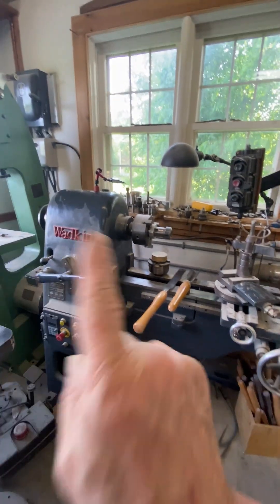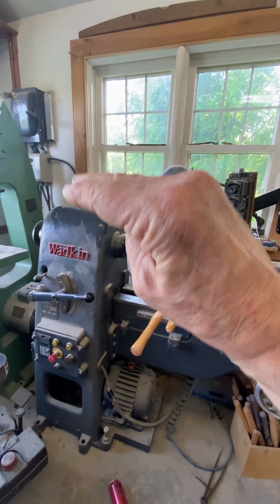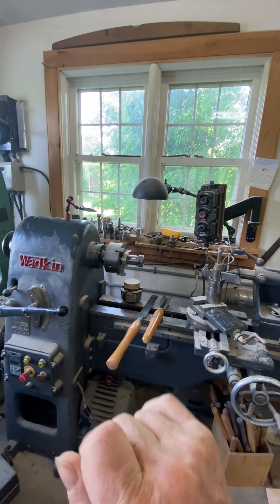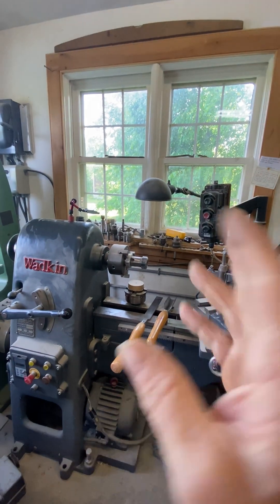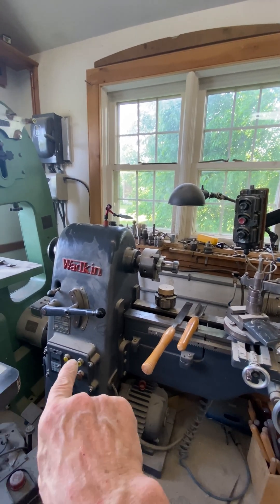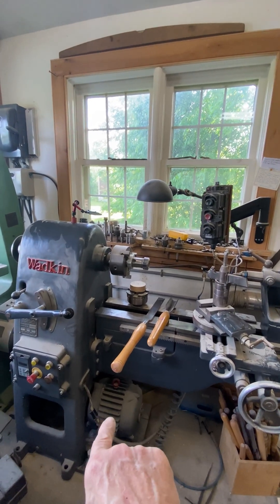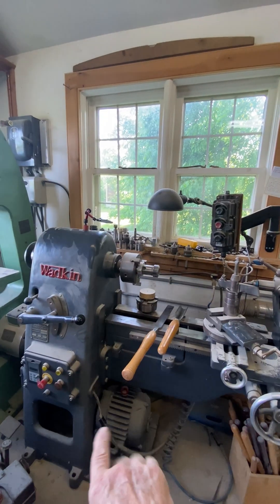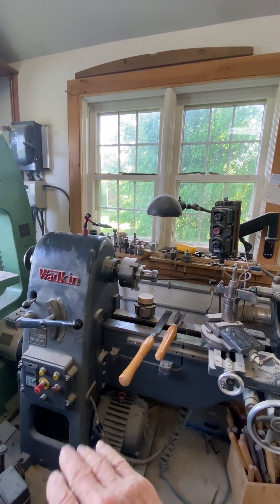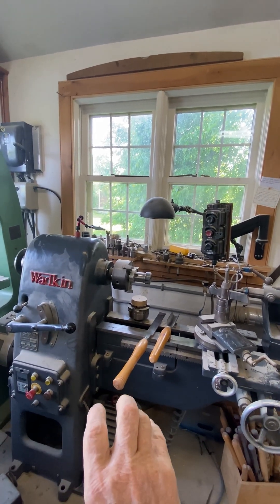I would not connect to the high-speed side of the motor, the 3600 two-pole motor. I would hook to the low-speed motor and raise the frequency to 120 so that I can double the speed of the low-speed motor, which is basically the high-speed motor. The advantage of this is when you lower the frequency below its rated frequency it is directly related to horsepower — lower it to 30 and you're at half the horsepower. Whereas if you use the low-speed motor and double its frequency above the motor's nameplate frequency, it remains at constant horsepower, so there's much more horsepower directly at the chuck.